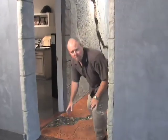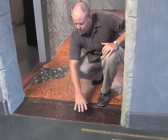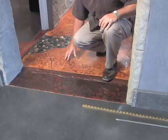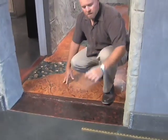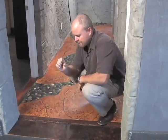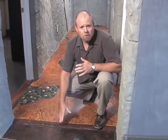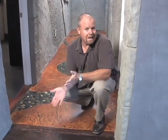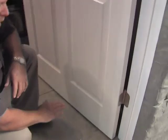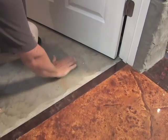Here's a perfect example of how you can transition from one floor height to the next. On this side we have our polished concrete; on this border we've put a nice decorative epoxy accent, and then we've stepped up three quarters of an inch to allow for our stampable overlay. There are several ways that you can adjust for this transition height. There are prefabricated strips that come in a variety of different colors and shapes. Certainly when you're going as high as three quarters of an inch, you don't want a square edge — you'd want a rounded edge. In our case, what we did is we cast them out of concrete because we wanted a stained concrete look, so we cast them out of concrete and actually stained them. In this office here we step back down three quarters of an inch, and we'll come back and put our stamp overlay which will marry up flush, so this will be a seamless transition.